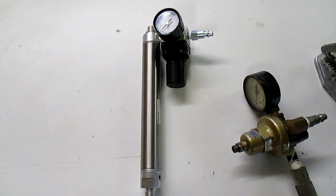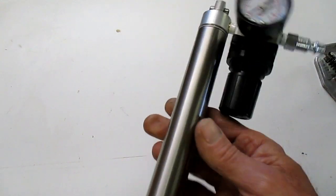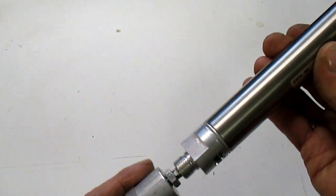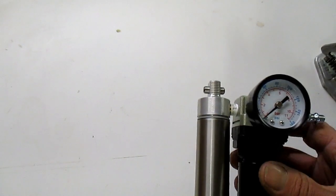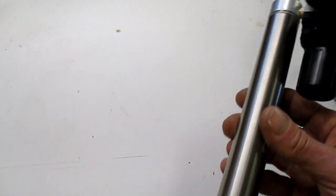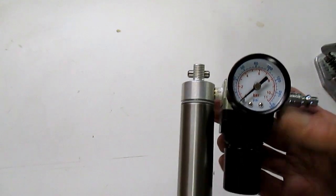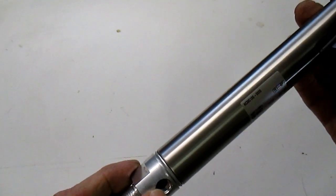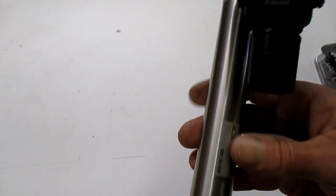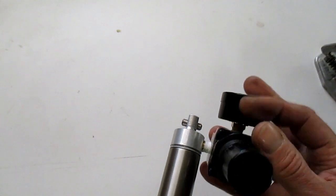So I finally knuckled down and bought the production unit. All your compressed air is in the cylinder here, so you're just relying on pressure at this point. There are a few things I'm going to change on this that will make it better for my application. The way the unit came, it has a port on the top and a port on the bottom — it's a dual-acting cylinder, it'll push or pull in either case. But I wanted these ports to face out.